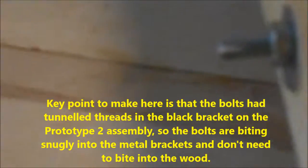I do have bigger, thicker bolts right here. I've got a bigger bolt here, and of course I've got the sheet metal screws, which I want to show you. These things really bite. They hold, man. So we're looking at self-tapping screws, if that will focus in, and they are 1.5 inches, right? They're designed for metal, but I'll tell you what, just from the weaknesses that the previous pallet ripper, the second prototype I did, had shown, when you see how well everything held up, the only thing that was bent were those small screws that were fastened into the tongues, because they were too small. So I know these babies are going to take a beating, right? They have a shank with the thread only cutting into about right there. The rest of that is just all shank.